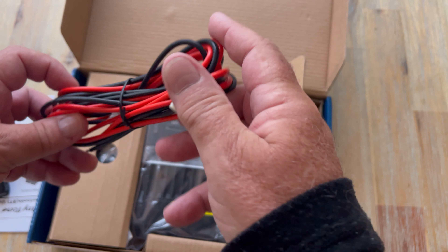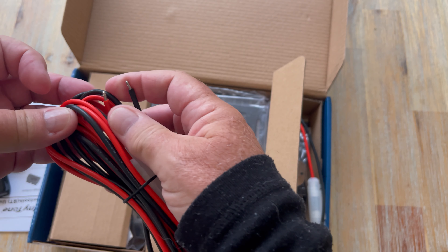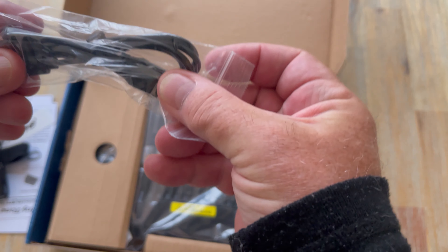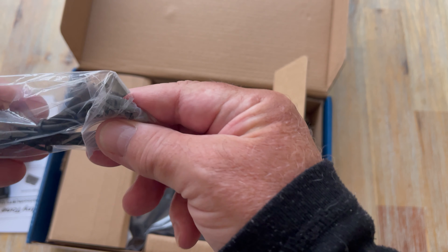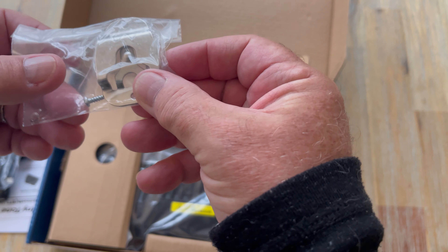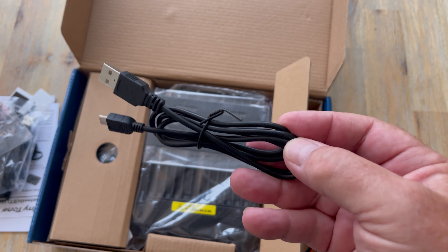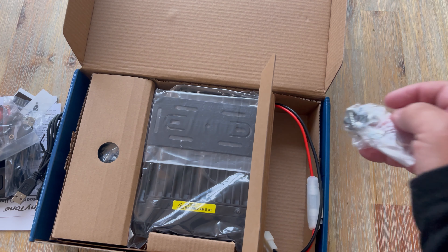It comes free with the radio, which is absolutely fantastic. We've got the power lead, and that looks like a standard Kenwood style of connector. At the other end you can see they're just bare wires — I'll be putting Anderson power poles on this. Nice to see both positive and negative fused. In here as well we've got what looks like a USB lead to micro USB — that'll be for programming the radio. Also a microphone clip, and another USB lead to micro. So one of them will be to charge the Bluetooth button, the other one for a programming lead — possibly a bit overkill including two in the box, but there we are.